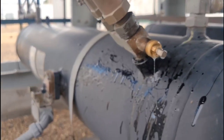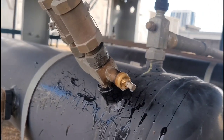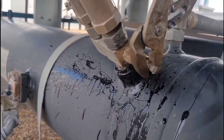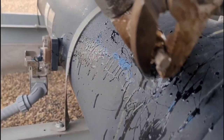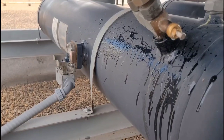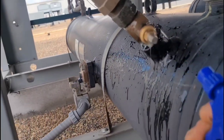This is totally preventable. You've got to tighten the backup nut on these king valves like this. If you don't do this, they're going to leak. And then on top of that, you don't put the cap back on it with the O-ring right — that's unfortunate. Come on, man.